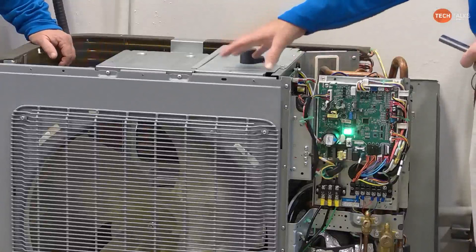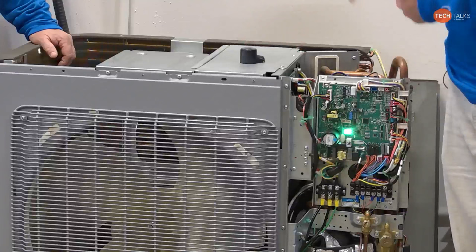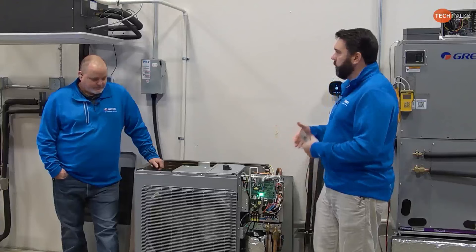If you hand me a startup sheet, then I can rule a lot of things out before we even get started. And if you send me a job site sheet, then after sitting down and reviewing it, just for an example, the debug on the MultiPro, you were able to use that, look at the temperatures, and determine that the system was low on pressure without ever going any further. And you knew what it was. So that saved how much time? Having to get the gauges out, hook them up, on the phone, trying to get these things.